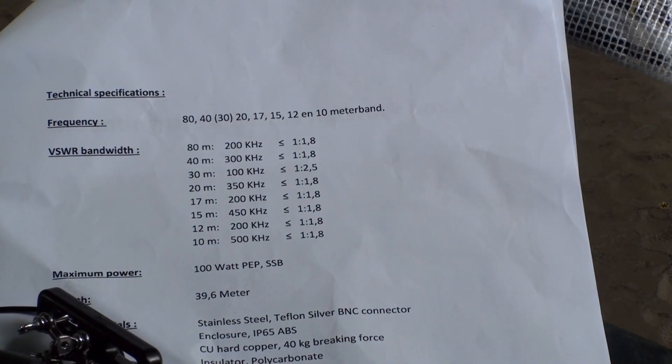The high-end-fed field day antenna covers 8 bands. 2-to-1 standing wave ratio band-wide resonant coverage without the need of a tuner is provided on 40, 17, 15, and 12 meters. On 80 meters, the antenna is resonant on a user-selectable 200 kHz slice. The included 80 meter jumpers allow the user to set the band coverage most suitable for the deployment. Your choices when setting up are 3.5, 3.7, and 3.9 MHz.